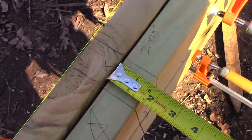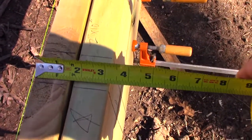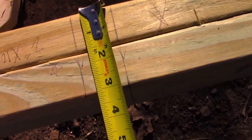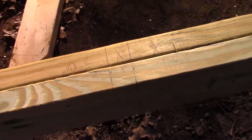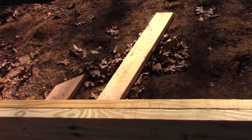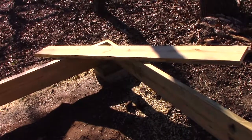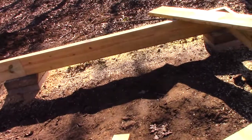I know these boards have a good gap in there and it's measuring three and three-eighths. This one is measuring an inch and a half. But both of these added together, it's three and a quarter or so. So this gap in between is adding a little bit of space. I'm going to keep it a consistent 16 feet — I'm going to keep the joists at 91 and a half inches — and then put them in and see where we're at.